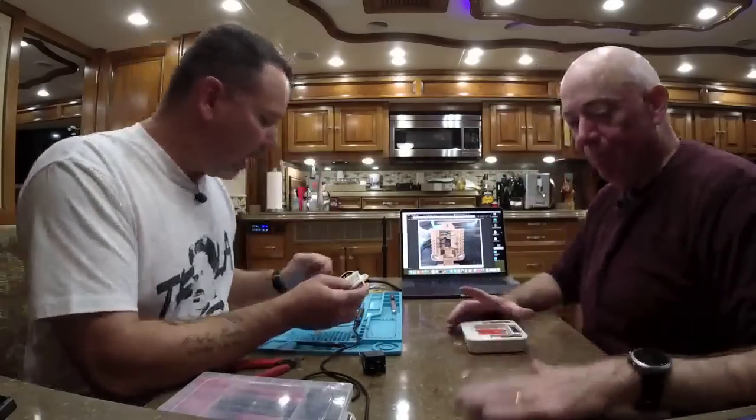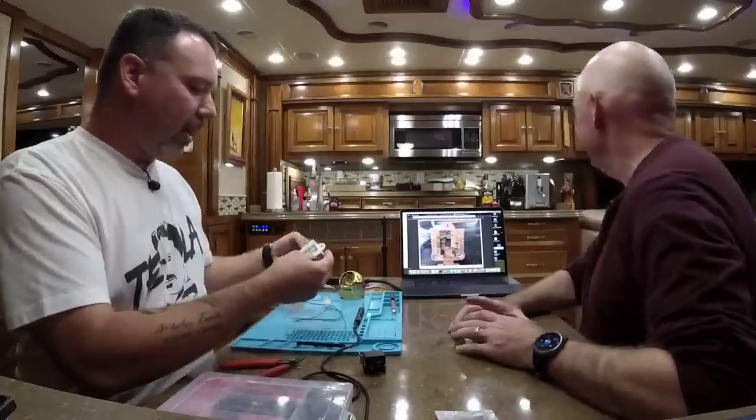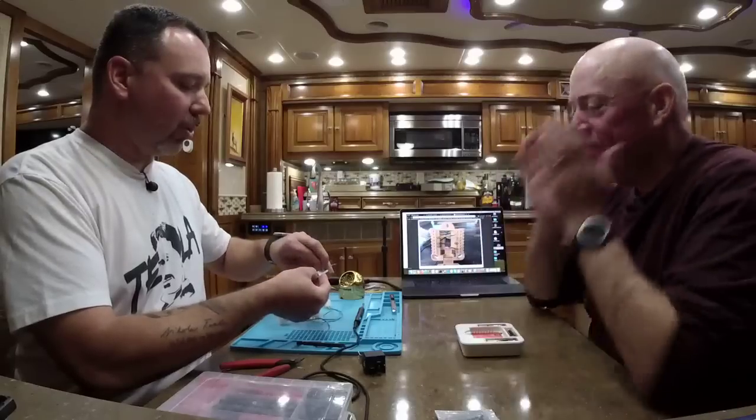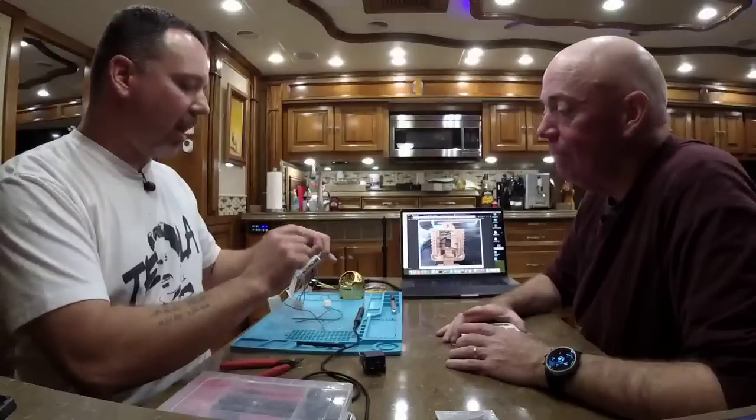All right. And then we've got a white-black wire that goes in the OB port. What's OB stand for? OB is actually the one that switches. It's normally for a reversing valve on heat pumps. And we're going to use this output to drive the relay so that it basically emulates the heat pump.